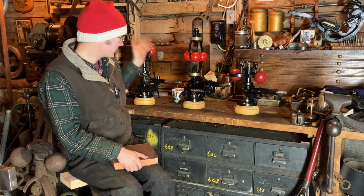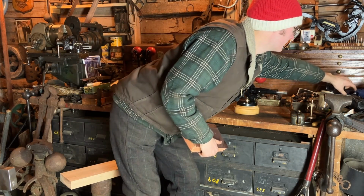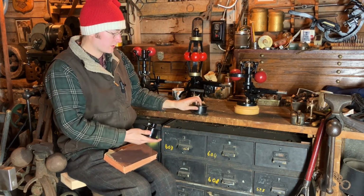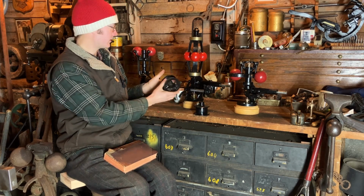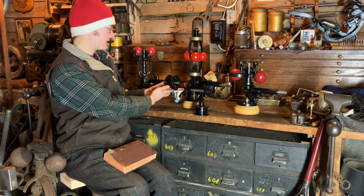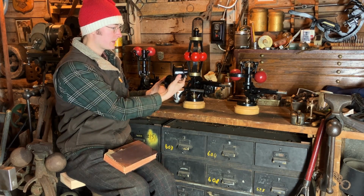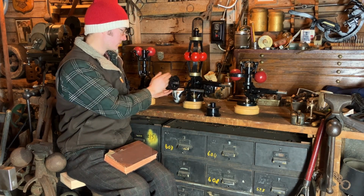So if I grab a pulley, here are a couple examples of governor pulley. This one's very simple, symmetric, slides on the shaft. There's a set screw that locks it. Both of these pulleys, you can see, have these little outer ridges. Those are to keep the belts on if you have a little bit of twist, and so the belt doesn't walk off.